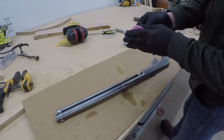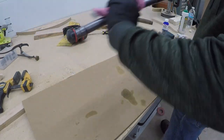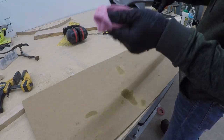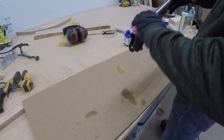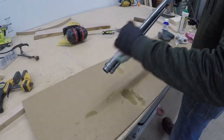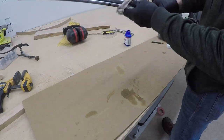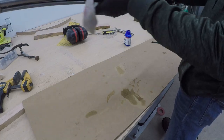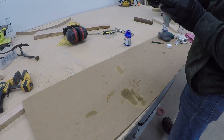I apply the cleaner degreaser with a clean shop rag, cleaning it very well getting into all of the nooks and crannies of the gun. I then wipe it clean with a wet towel. After wiping it clean, you will want to change gloves and not touch the barrel with your fingers — the oil and grease on your fingers will leave marks in the barrel when bluing.